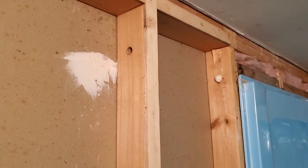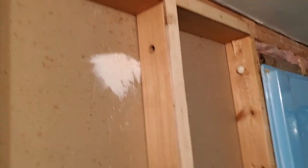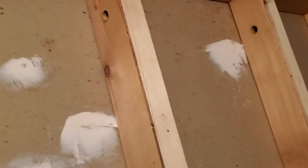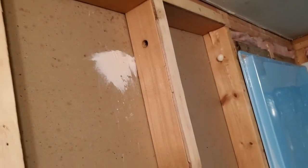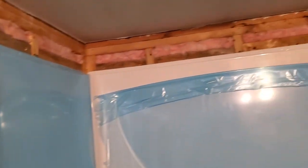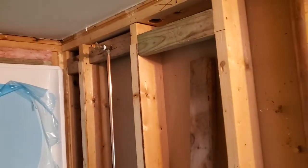But in this case, or anybody's remodel, generally you're going to have flush 2x4s and they want you to overlap that flange, so you're going to have to fur out all the rest of your studs in the bathroom — on three walls, of course: both the surround sides and the back. So if you have a huge bathroom, there's going to be a lot of furring strips.